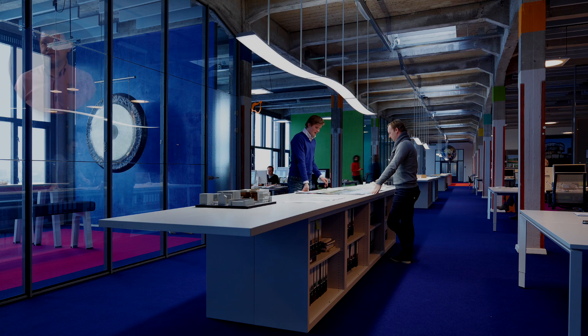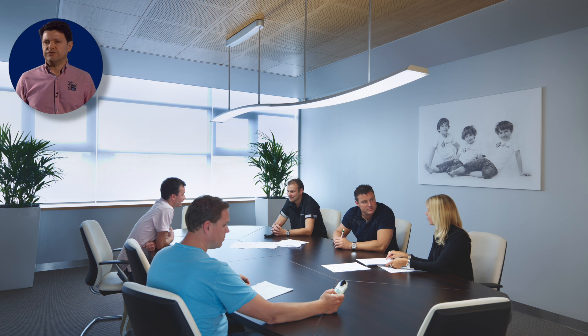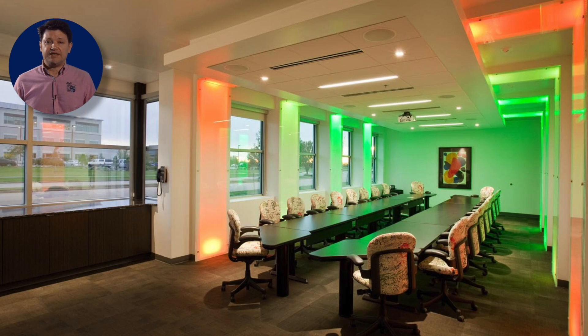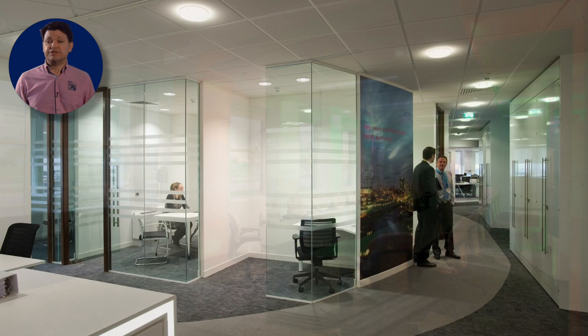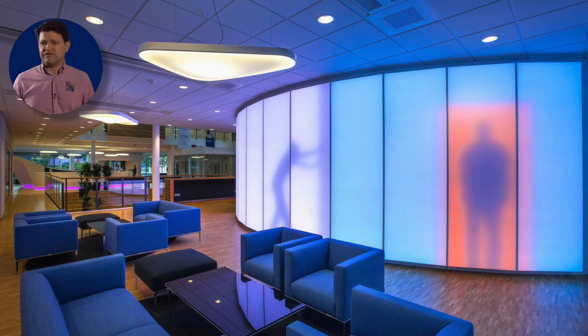This is a short video about saving energy by using lighting controls. Remember that in most countries, regulations require you to fit controls to reduce energy consumption. There are two basic control techniques you can use, and these techniques can be used individually or combined to give maximum energy saving. Even the simplest control method can reduce energy consumption by 25%, and using more controls and sensors in combination can lead to energy savings of up to 60%, sometimes more.